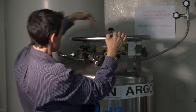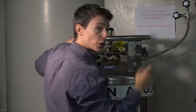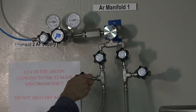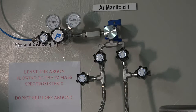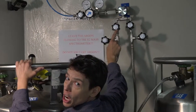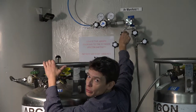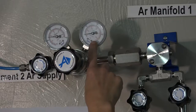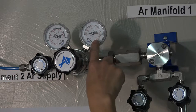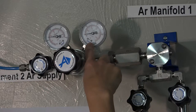Now that we have our pressure builder on and the use valve open to the wall, we're going to purge the line. Purging this valve, you just Lefty Lucy open it slightly and then close it. That lets you know that the argon line has filled the entire line. We can now open the argon to the system by opening this valve here. Lefty Lucy turning it all the way open. Once you feel a little resistance, you know that it's entirely open. This gauge should equal this gauge — it's difficult to read because this pressure goes up so high and we're only looking at 300 PSI, but it does register the same number.